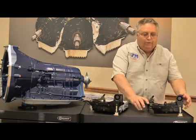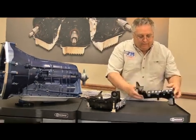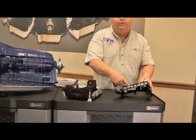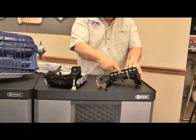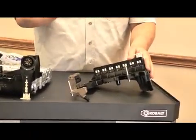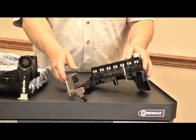We've also found that on those solenoid connections, metal tends to collect on these terminals here and tends to foul or give improper signals back to the controller. So for the money that's invested in this, it's well worth it.